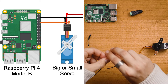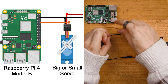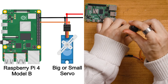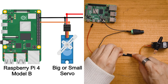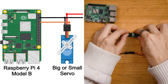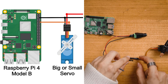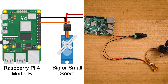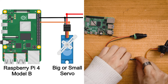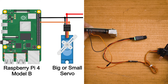Connect the ground pin of the Raspberry Pi to the ground wire on the large servo — black wire to the dark brown/black wire most commonly seen on big servos — by connecting the two black wires to the DC power jack. This will attach the ground to the power supply as well. Then connect the power wire of the large servo, commonly a red or dark brown color, to the 5 volts of the external DC power supply. To send the data signal, I will again use GPIO 18, which is pin number 12, as the data pin telling the servo the direction and angle to turn to — usually an orange or white colored wire. With that, everything is all connected up for the large servo.